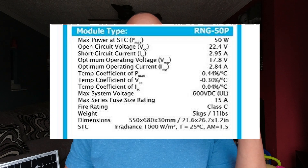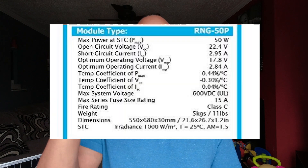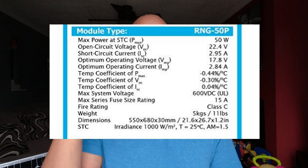We also need to talk about those numbers on the back of the panel — they're rated in two separate ways. There's the amount of power that comes into that solar panel when it's not connected to something, which is typically noted by the VOC (open circuit voltage). And then there's the amount of power it can produce when it's connected. Whichever number is the highest on the label is typically the open-circuit output; the one that's lowest is your operating output.